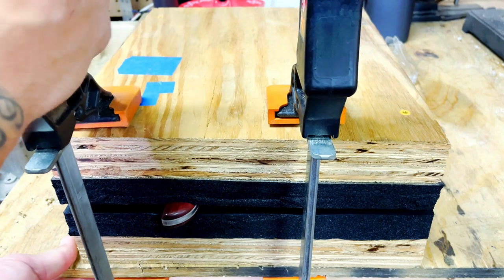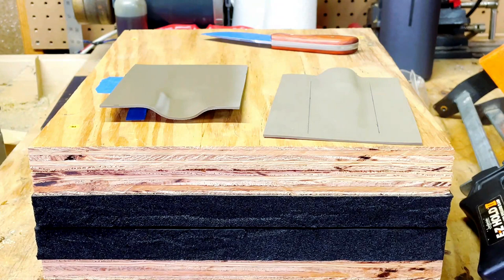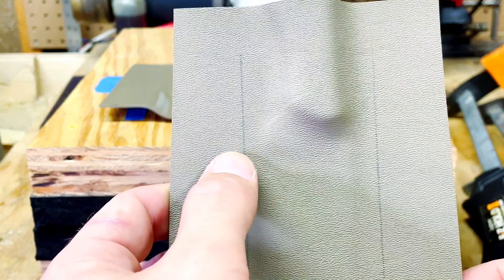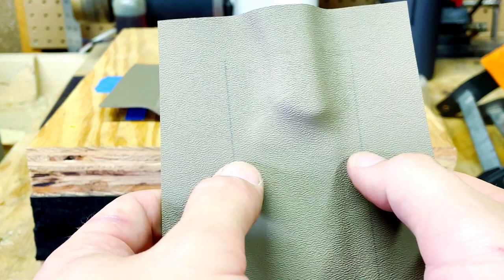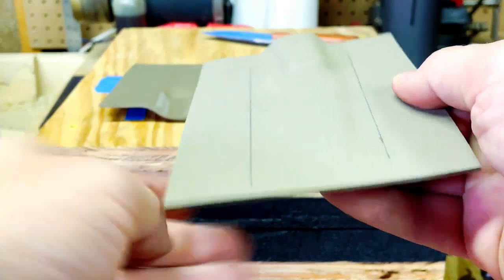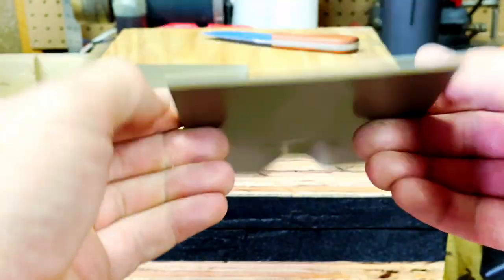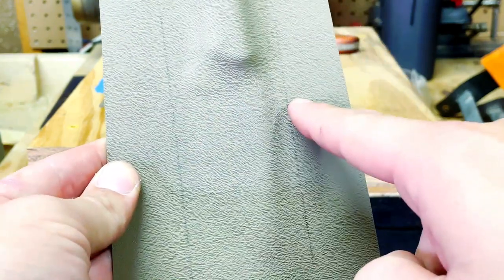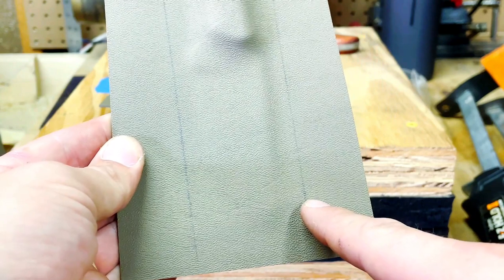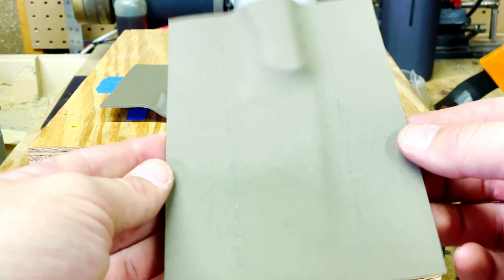These are the guidelines for the eyelets we'll put in. I put mine three-eighths of an inch away from the blade and the choil, then I'll put a straight edge to see what looks straight off the shadow casting from the impression. Once I do that, I go the same width from here to here and the same distance to each point, draw a line, and at that point I know it's all symmetrical.